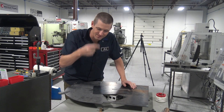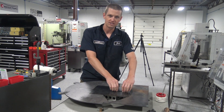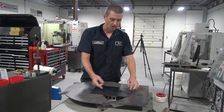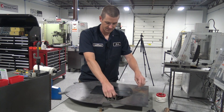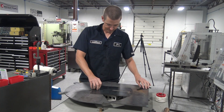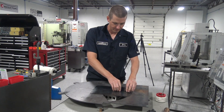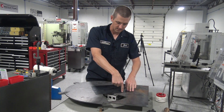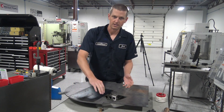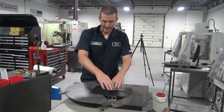I made one huge mistake - just never even thought of it. The idea was you would have a vertical stack of these right here, so when it rotates back here it picks up another one. Well, that means I can't have this piece be a standalone piece. It has to be a full circle, because otherwise, let's say your feed stack is right here - when it gets to here it's going to drop a clamp out into no man's land. So I've got to recut this little piece of 16 gauge and have it be a full circle.